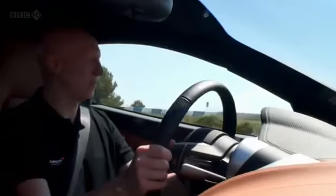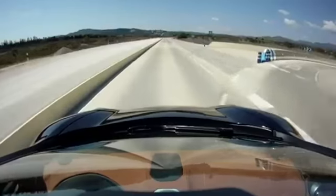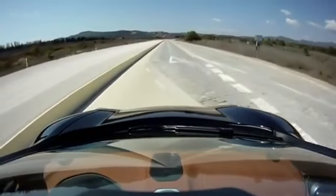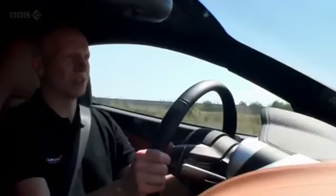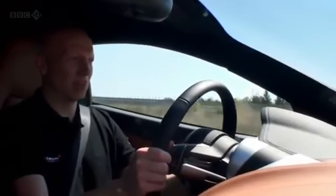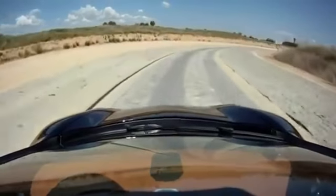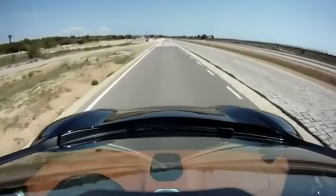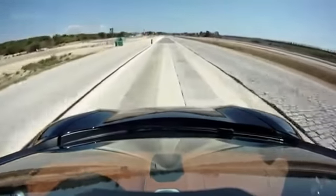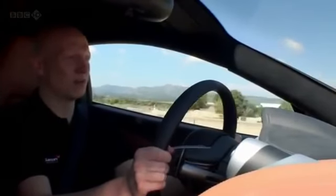So this surface is a specifically designed, badly maintained road. It will expose any squeaks and rattles. We're now going on to the Belgian pavé surfaces. So these generally give shorter wavelength inputs into the car and expose any kind of secondary ride issues that it might have, or if anything is going to drop off the car, it would be here. It does rattle you around a little bit driving over these things. These are the washboard surfaces, which are quite harsh, and not dissimilar to sort of cat's eyes on a motorway, but more severe.